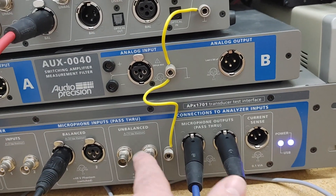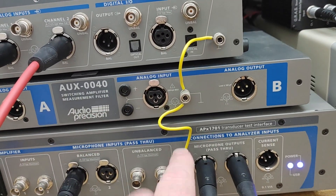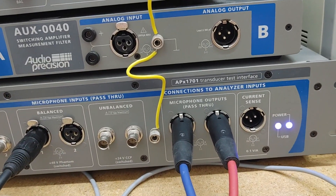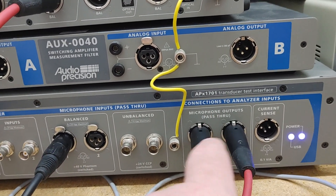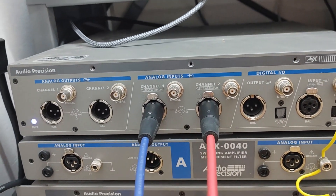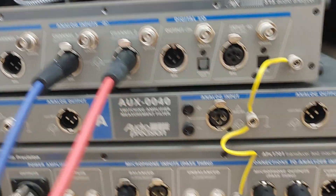This little connector here makes sure everything is connected to the same ground reference to reduce noise. The microphone outputs are balanced only — left and right — and they'll route whichever inputs I select to the outputs depending on what I want to do in the software. They go to the analog inputs, and pretty much the only thing I ever put in the balanced inputs are my microphones. Everything else is unbalanced, so it's easy to leave it wired that way.